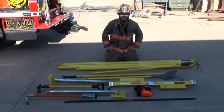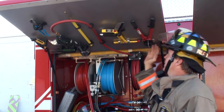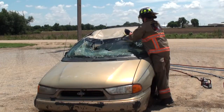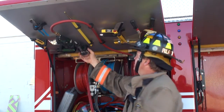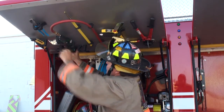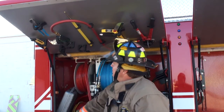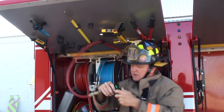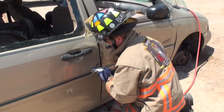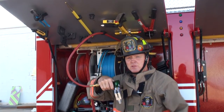Take particular note of this door and the equipment on it. Say I want to take out a windshield — here's my windshield cutter, bolt cutters, and air tools. Since we have air cylinders on this truck, we've got an unlimited supply of air. Here's a cutter and a little air shear. Instead of using a noisy chisel, I take the shear and rapidly open up sheet metal — it will quickly open up the side of a door so you can reach in and undo the latches.